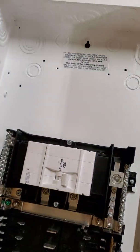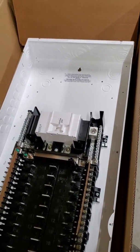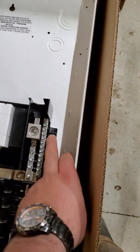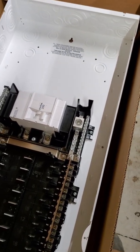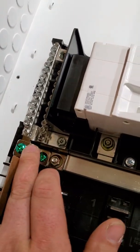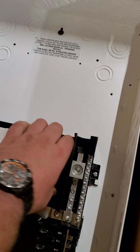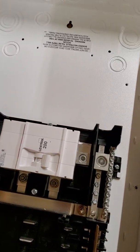So you're greeted by your terminals. In Canada we're required to have our service entrance mechanically separated from the load center. Here you've got the neutral connection and an extra neutral bar with oversized neutrals, so if you need a 6-3-10 or larger you've got extra terminals for it. On the other side is your main ground and then a ground bar up top, plus a bonding jumper. This is a 200 amp panel.